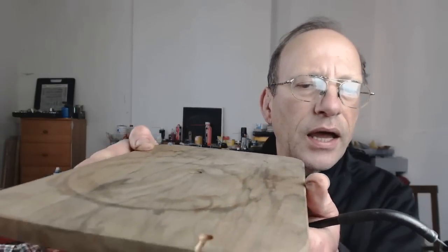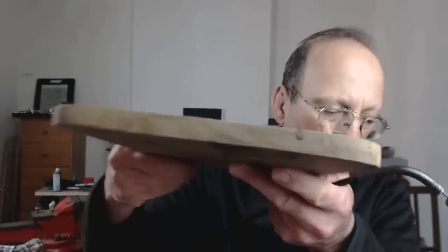The next thing I did, as you can see, I slotted it using a jigsaw blade. It's a bit thicker than a hacksaw blade, and took it down to 4.5 millimeters because the Bowden cable is 2 millimeters, and it's 8 millimeters deep. So I needed to get it down to 4.5, and that leaves a little bit left to finish with a drill, so the depth would be 5 milli, and then the Bowden cable would be perfectly